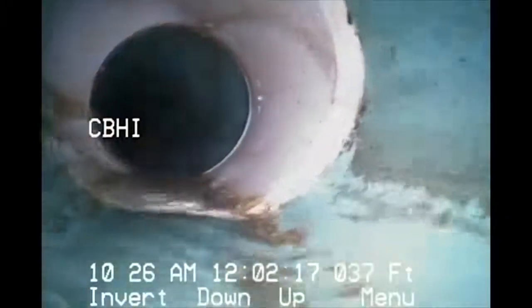This house here, we are a townhome, so we're picking up right about here. We're starting to pick up another line, which is the neighboring unit. Here it looks like we're picking up another line. That's what those are. Sometimes you'll actually see that when you're pushing through on a house and they tie in an outside line, or if you're going through a basement floor, you're just seeing where they tie in other components to the house.